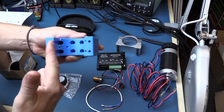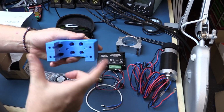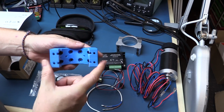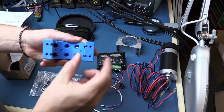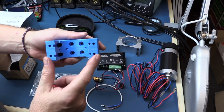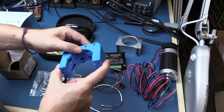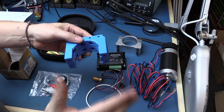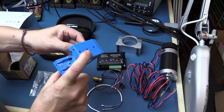So what I did was chop off the edges to make it flush, just to see if that would work. Either way, this was either a wasted print or something I could adapt. I had done a 60% infill with thick walls, so it will easily support me doing this. Once I've confirmed that this will be firm enough, I will complete the design with a different clamp for the top and reprint it, and I'll show you how I did that in a separate video as well.